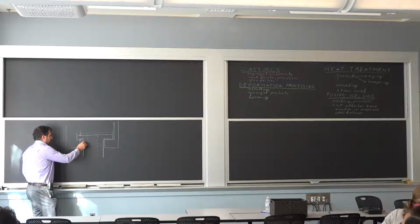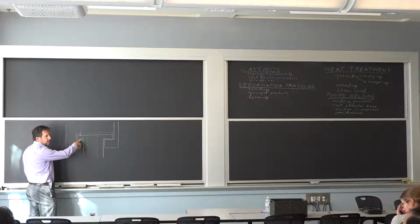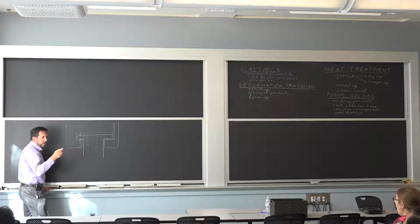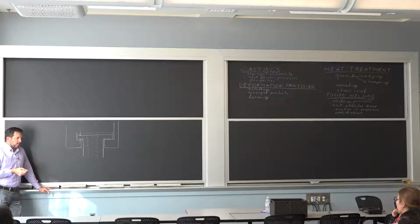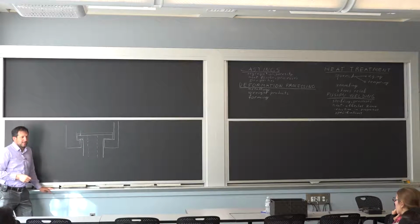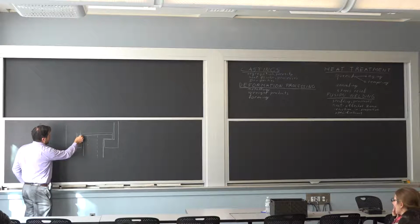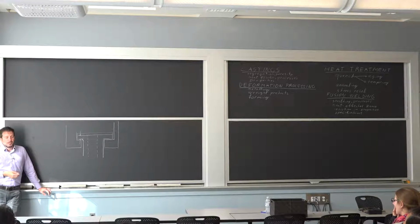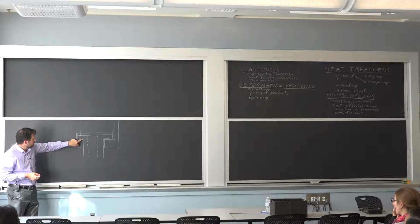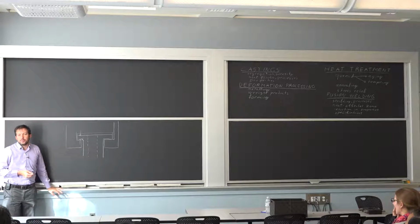Locally, the stress has to transfer from this wall all the way to the support here against the nut. If it's a sharp corner like the one that we have there, you expect the local stress to be between 3 and 10 times higher than the average stress. So you can make it 3 if you have a radius, or you can make it 10 if it's really, really sharp. It seems obvious that you would want to have some radius, to the extent that you make this thick enough so that the fact that you're not touching for the first little portion doesn't make a big effect. So you have to make the two changes. If you just add this corner and then make the ID of the nut a little bigger, then you're increasing your bending moment on that flange.